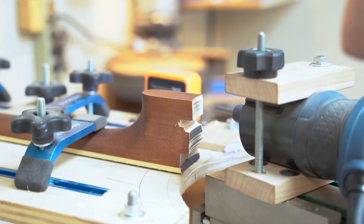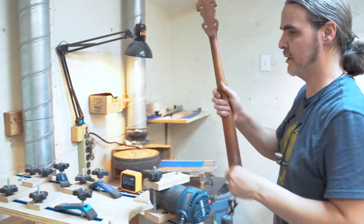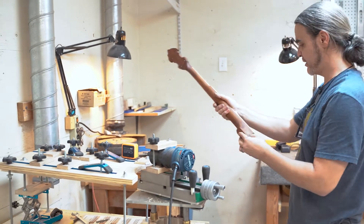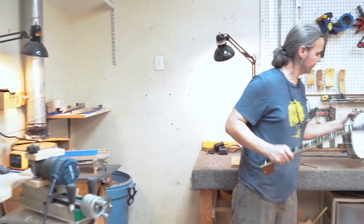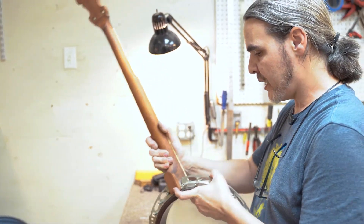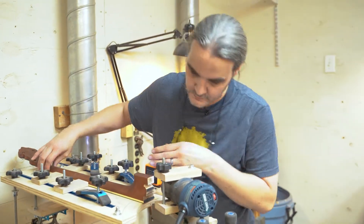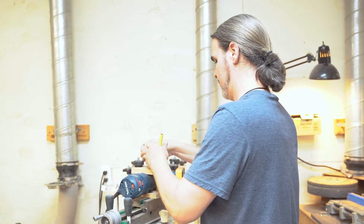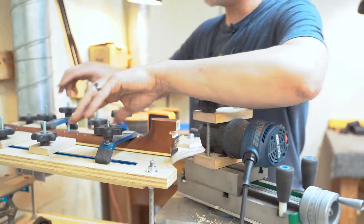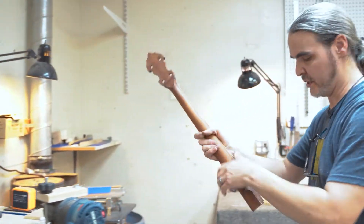All right, that's basically it. Now the good thing about our jig here is that I can just put this neck right back on there and make any adjustments I need to make. It looks like we need to open her up a little bit. You're just going to go little by little until it's nice and perfect. Try to take too much off at once and you've got a big old gap.